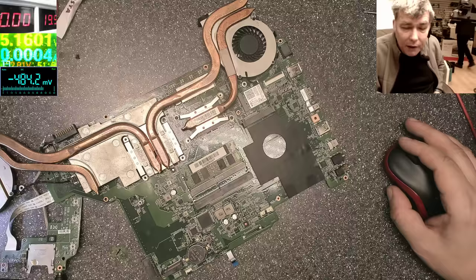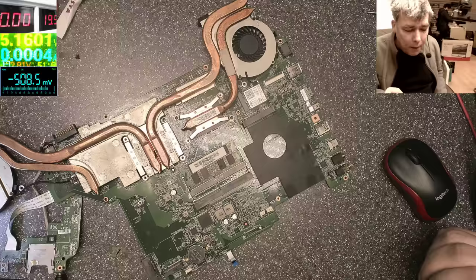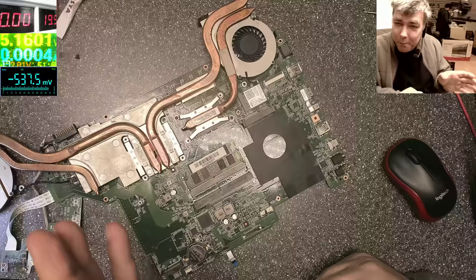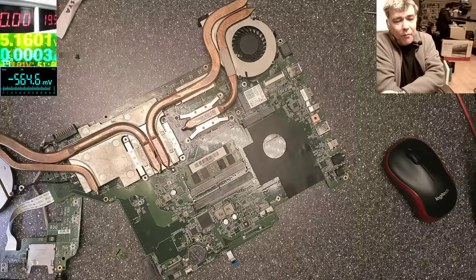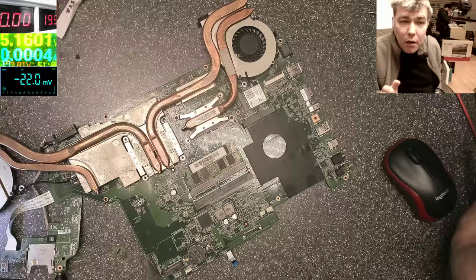And I explained to him, wait, they made a lot of mistakes replacing the screen without taking out the battery or the charger, but in most of the cases you actually have picture but no backlight. So I told him, usually it must be picture but no backlight. Do you have any picture? I said, no, I have no picture. Actually, it's not even coming on. So, you know, that's the point when things can go very, very wrong, when you are playing with the screen connector without taking out the power supply or the battery.